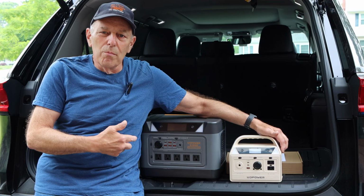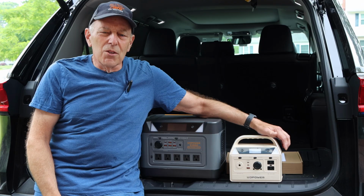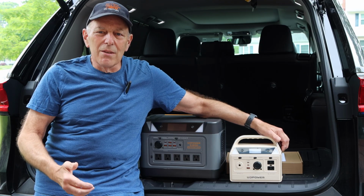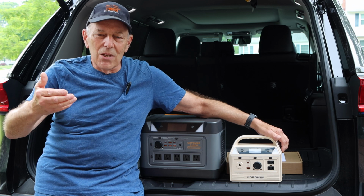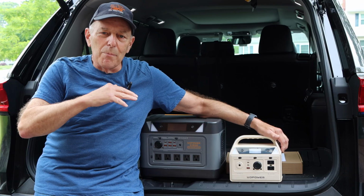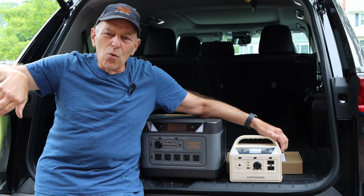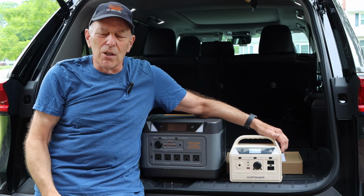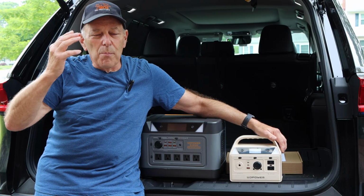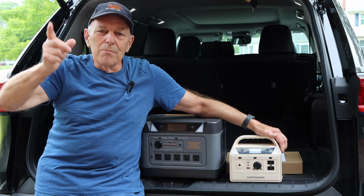If you needed to run a small mini fridge, or a sump pump, which is super important where I am. This is now getting into hurricane season, and being prepared for a hurricane is better than trying to do something after the hurricane has hit and you have no power and your basement is flooding. The basement here is actually 8 feet underground, and around the pump itself is what's called a sump. The water from the outside perimeter of the house goes into that sump, and if the power was to turn off, both my primary and my secondary pump would fail and the basement would flood.